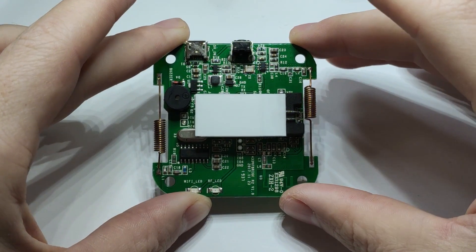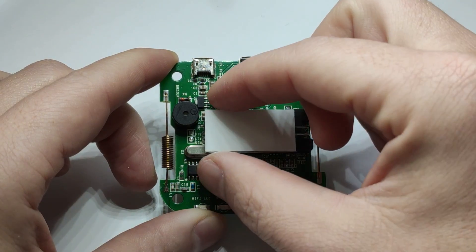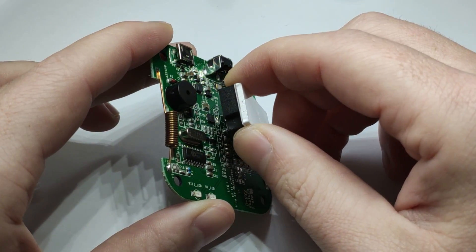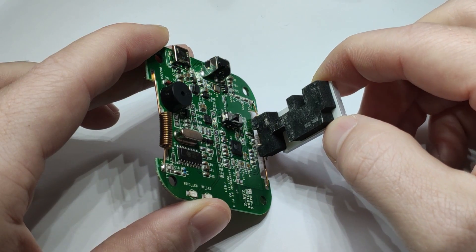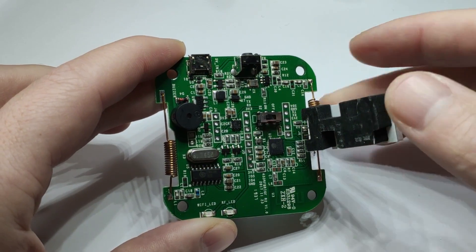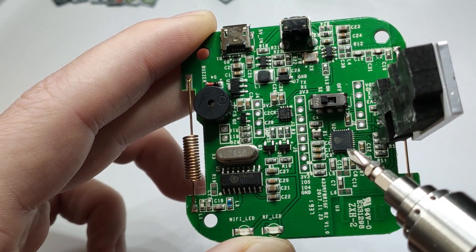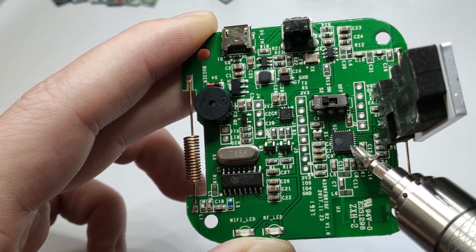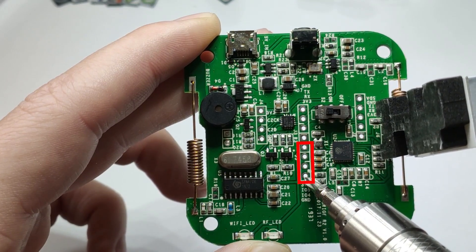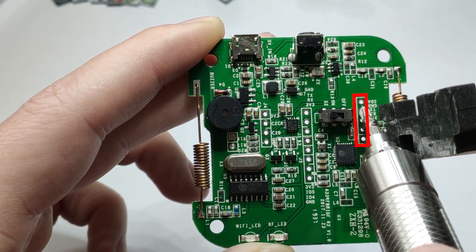Four screws hold the device together. At the bottom of the PCB you'll find two GPIO pins — 12 and 14 — and two antennas. If you peel off the RF chip label you'll have access to the Wi-Fi chip, which is not an ESP8266 but an ESP8285, so be extra careful when bending those pins otherwise you might break it. On the board you can see the ESP8285 chipset and there are also a couple of sets of GPIO pins at standard pitch. There's a serial interface, exposed GPIO 4 and 5, an SPI interface, and another serial interface also used for flashing.